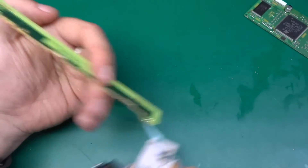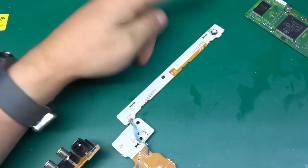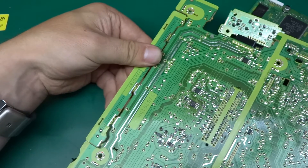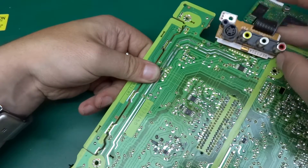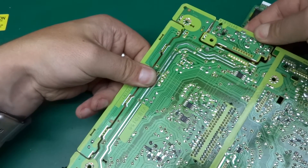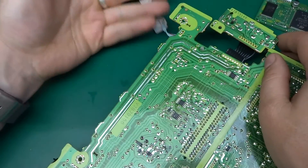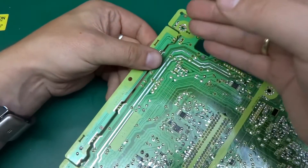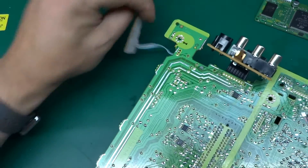This board over here is just a power button — it was sitting like this in the case with a button and lever pressing the power thing. What they've done is actually quite clever: this board came from straight over here. It's actually quite common to have those little separate boards cut out from a nice rectangular piece. Same with this one that holds just the audio and video connectors on the front panel — it came from exactly this piece too. The whole board as one makes a perfect rectangle. During assembly they just break the tabs, and that also means they can populate both ribbon connectors and put everything through the wave solder. Then during assembly they tab them off and manually put them in the right places.